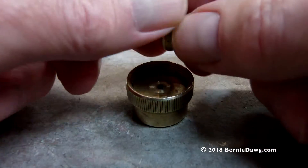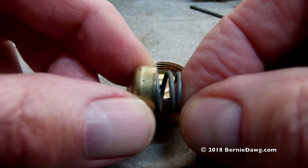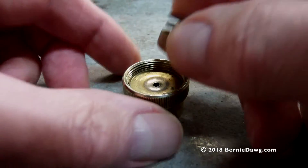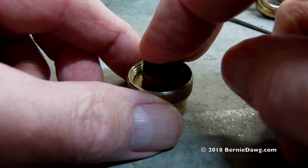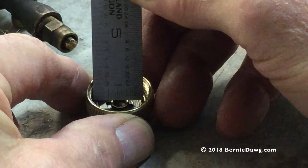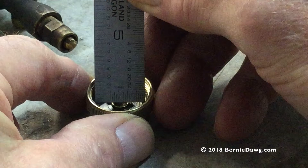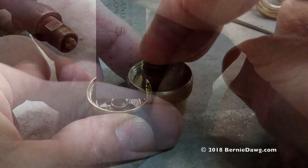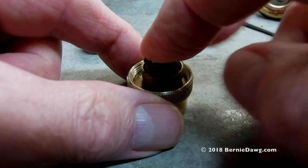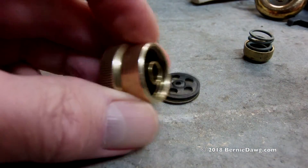The inner seal is created by the pressure of the piston and the spring pushing down on the brass and rubber seals against that center inner small ring. If you hold a straight edge across the outer ring, you can see a distinct gap between the end of the edge and the inner ring — that inner ring is set down a little lower. It's the powerful spring that pushes it down against the seal.